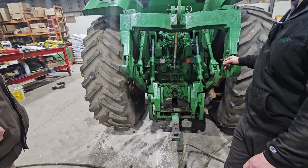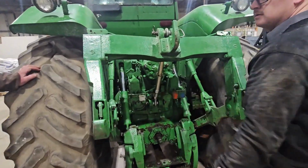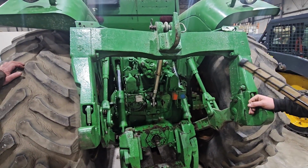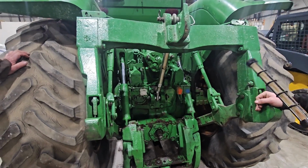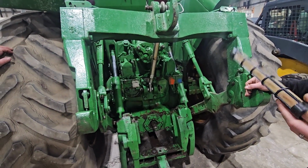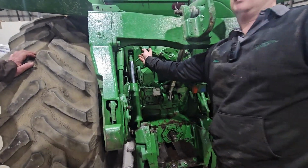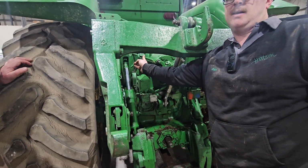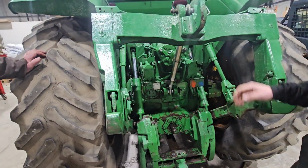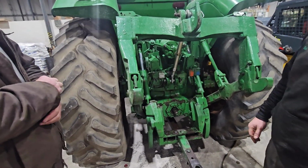Okay, fantastic. All your SEVs all work. I hooked up to those and tested them. Your clutch pressure is great. Your lube pressure is great. It's got all new filters. I think I have one more of these over on that bench I'll send with you. That way you can keep it clean. Just use duct tape or black electrical tape and a shop vac on that fill hole, and then the oil can't come out because it doesn't vent.